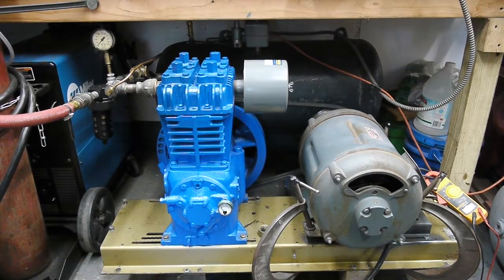Because that motor was sealed with no internal fan, I believe it was for some sort of industrial application — maybe closing airlock doors or a heavy-duty winch — where contaminants couldn't get into the motor and it was only run for short periods. I plan on running this for 20 to 30 minutes and will install a couple of external fans to keep the motor cool. In previous tests, I could drop internal temperature by as much as 50 degrees with just a simple cooling fan. The motor is belted to the compressor in a two-to-one ratio, so every two rotations of the motor equals one rotation of the compressor, running at 885 RPM — very close to the compressor's governed speed of 900 RPM.